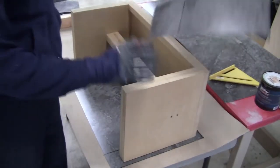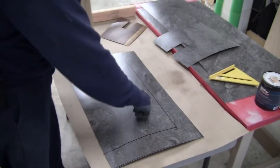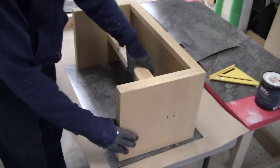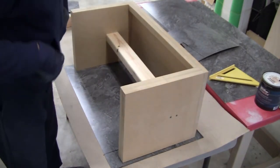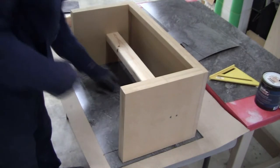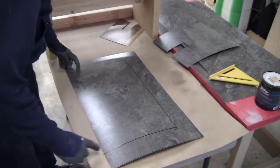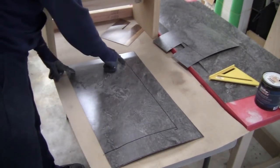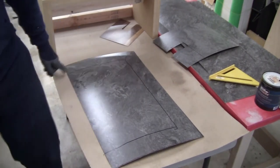In order to make the second piece, I'm planning on using the inside cutout with the factory edge. I put this down, made sure I had overhang all the way around, and used my black Sharpie to mark everything. I'll make the two straight cuts with the table saw, and then I'll have to do the angled cut with the circular saw because it's inside to inside. Let's get to it.